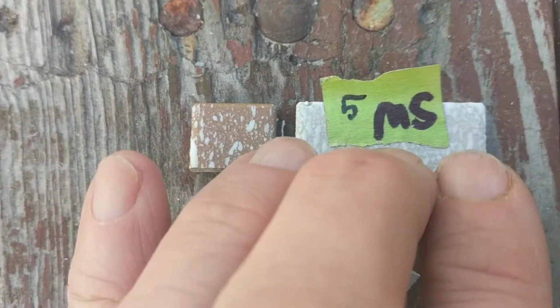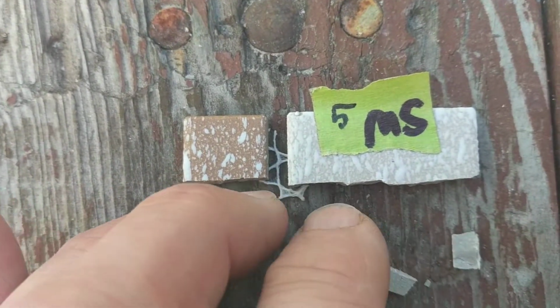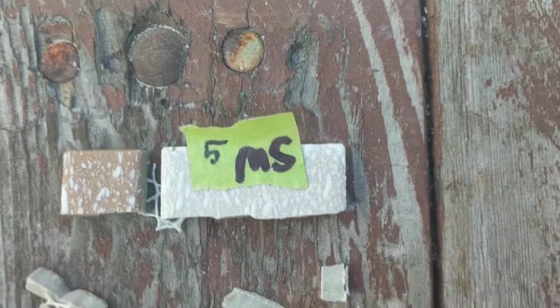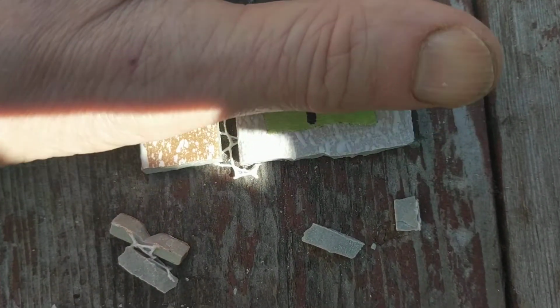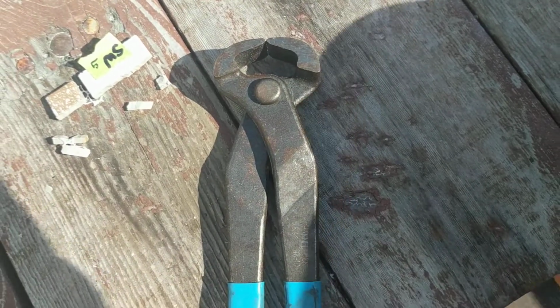This, of course, is going to be hidden under a trim board. It's just going to give me about 1/8 of an inch clearance for the wall. It's very time consuming to do this for a larger mat. I'd already cut entire mats using a 4-inch porcelain blade. I could have somehow clamped this down in a vise, let's say, and got the blade, and made a nice clean cut across that. But honestly, I was a little curious, and I wanted to see how these would compare with tile nibblers.